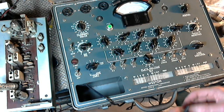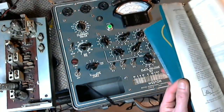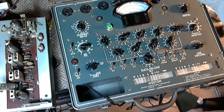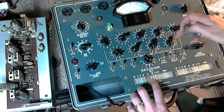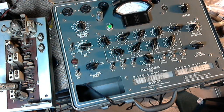The rejection point is 960 micromhos times 3. Okay, I think we're good. Everybody ready for the excitement as I plug this in? That thing that happened to the last tube — of all the tubes I've tested over the years, that's the first time I've ever had a tube turn into a light bulb on my tube tester. I could damage the tube tester like that too. So hopefully the tube tester is still working — it's got a fuse. Let's check for shorts. No shorts. And here we go on the GM test. Oh my gosh — it's not even showing up. Another dud?